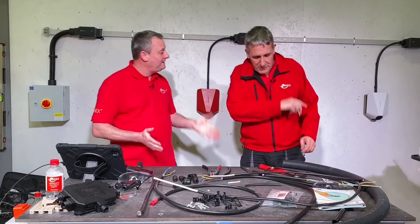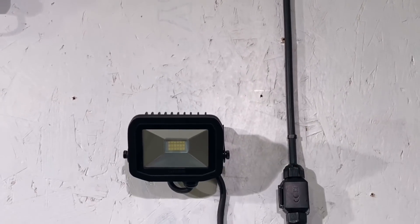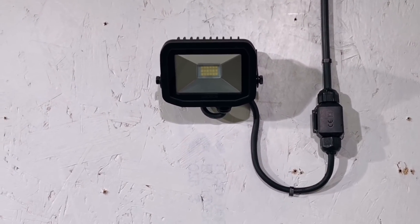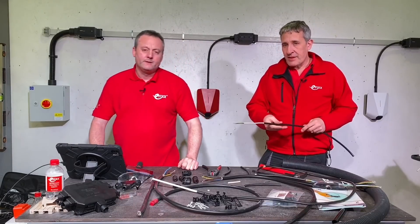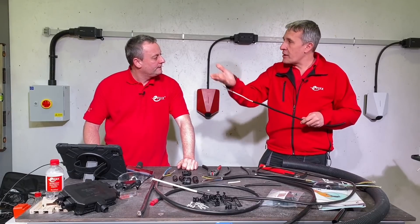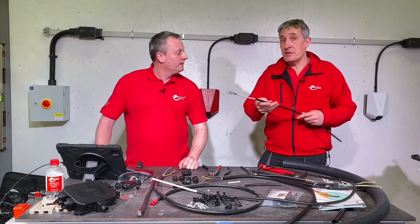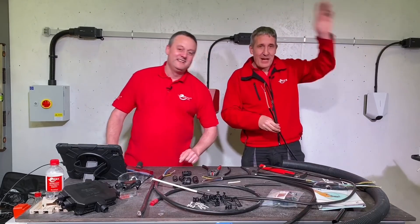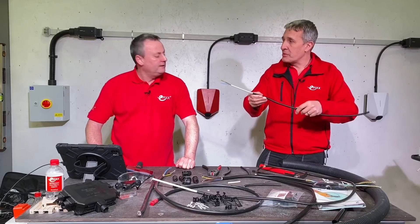We also used it on a lighting circuit — partly because it looks considerably neater. We came out of a fuse box, brought out some tough sheath cables, went down to a little Fred box from Raytech. It looked incredibly neat, which is the advantage you get with this cable. Using it outside, fixing cables directly without additional protection can cause challenges, particularly with twin and earth — we've made a video on that.